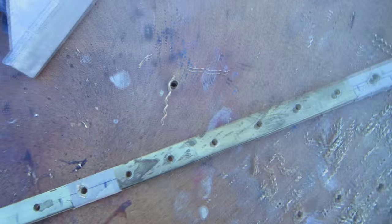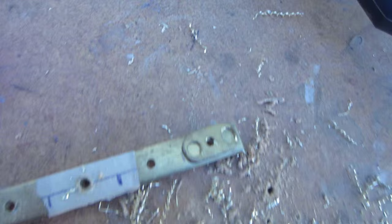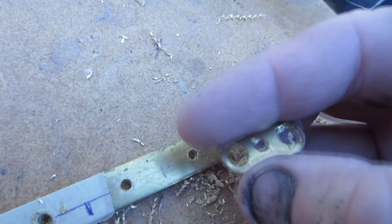Alright, so all of those are drilled — those are the center holes. One side will be tapped, and then the other side will be made bigger for the sprue. Then what I do is I use a template — this is one that just got messed up and ground a little bit too fine — and I set it on the hole like that, and then I just come along and mark the centers.